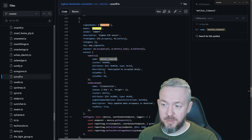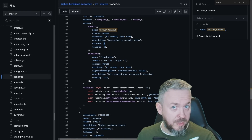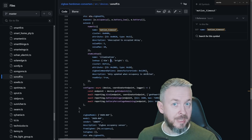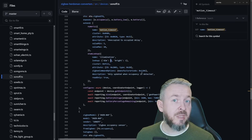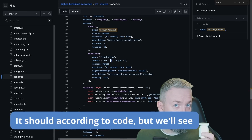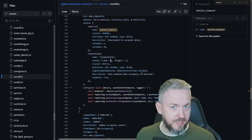The motion timeout is a customizable value between a minimum of 5 seconds and 60 seconds. There is also one additional functionality specific to the SNZB-03P: illumination. Dim is 0 and bright is 1, and it is only updated when occupancy is detected — the same behavior as in the official Sonoff ecosystem. The support in Zigbee2MQTT matches the official Sonoff support. I don't yet know if this device will support over-the-air updates in Zigbee2MQTT, but the presence sensor can already be updated via OTA through Zigbee2MQTT, so hopefully this motion sensor will as well.